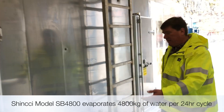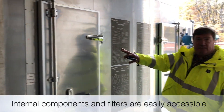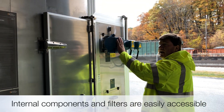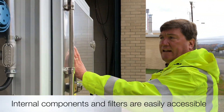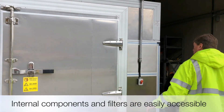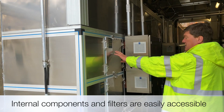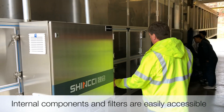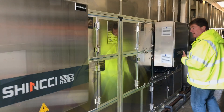That was the front of the machine; I'm going to walk to the back. You can see you have these nice access doors — you can get to the belts on the inside. All the motors and gearboxes are readily accessible. You can get into the end of the unit with this large door. On this side is where you can access the filters of these different panels, the heat pumps, filters, and bearings on both ends.